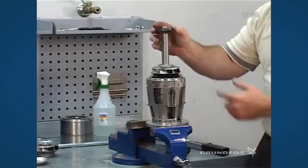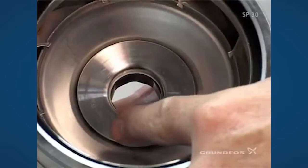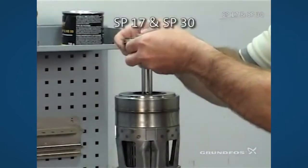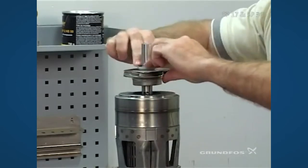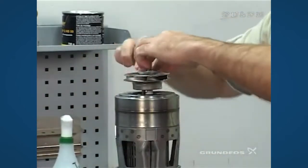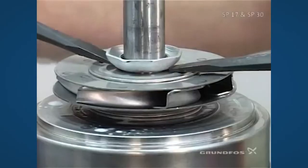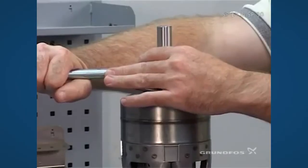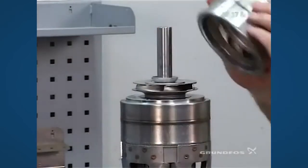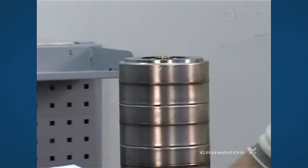At this point, take the bottom thrust washer, make sure that you're using the taper and that it's facing downward into the split cone nut. Fit the next chamber, which has the smooth surface on the interior, to slide down over the top. Push down on the split cone nut and lift up on the impeller edges. Just before seating, spray soapy water. Then tighten up the split cone, repeat the process, and fit the upper chamber.